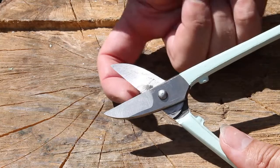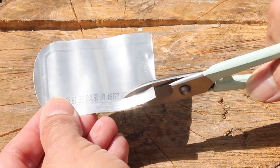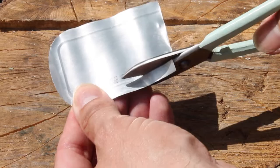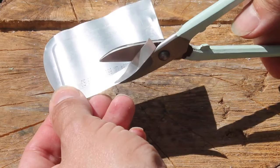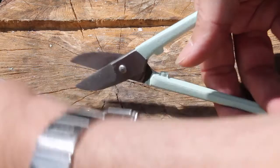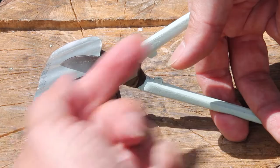This pair has rather small blades, so it's designed for jewellery work. When cutting a long thin strip, it's important that you don't go all the way to the end of the blades — doing so will create a little notch in the end of the cut. Only cut to about one centimeter from the end, then move and place the material back into the jaws. Repeat this action for a smooth and continuous cut. Because of the leverage, there's greater cutting power as you move closer to the pivot, so for tougher material, make a series of short cuts and keep moving the metal closer in towards the pivot.